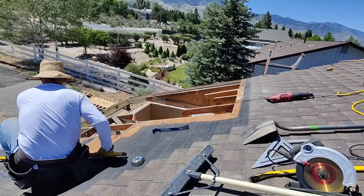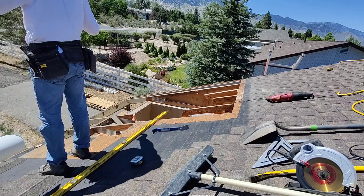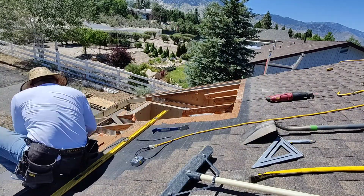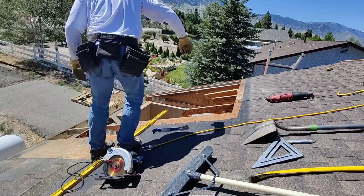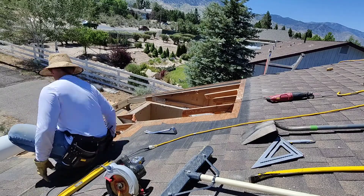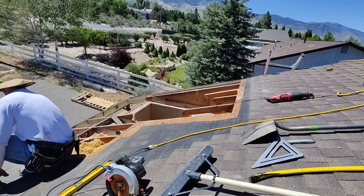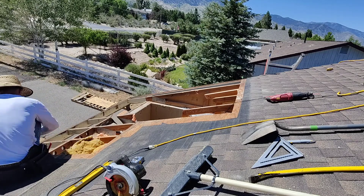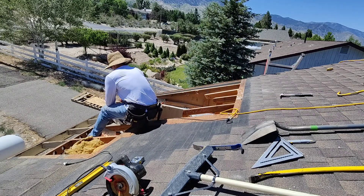Here we go, the next cut — let's hope I have more luck this time. A little plunge cut, saw set to the right depth so I'm only cutting through the plywood but not into the 2x4. And then we're yanking that off. This time I got lucky — the truss runs parallel, it's nicely supported. A little bit more clean up around the edges, and then we can finally get going with the repair of the actual roof structure.